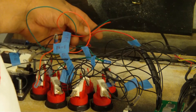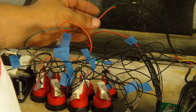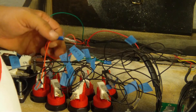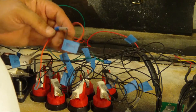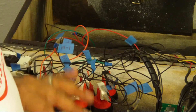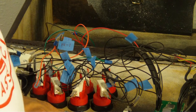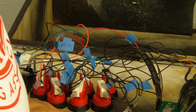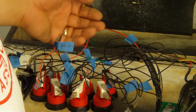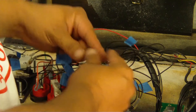Once your trigger stick is assembled, wiring it's even easier. It's only three wires — one for a ground, and one to go to each of your switches. I used spade connections to wire mine up with additional lengths of wire so I could slave it to a pre-existing switch. Of course, you could get a little fancier — you could even use a quarter inch or an eighth inch stereo jack that has three different connections on it, or some other type of removable connector, wire that into your control panel, and simply plug it in.